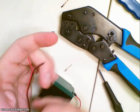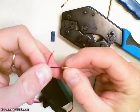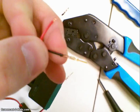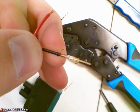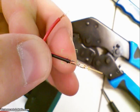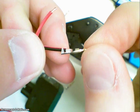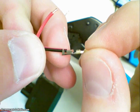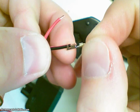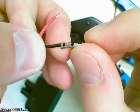When I put this in the crimper, it's going to go in and crimp just like this. So if we look right here, this has kind of two tabs: the outer tab is going to crimp around the casing, and then that inner tab is going to crimp right on the wire. That's kind of how that's going to sit inside of the crimper.